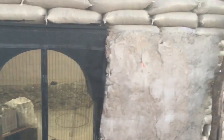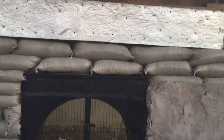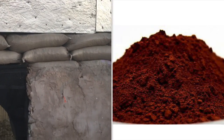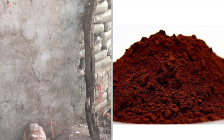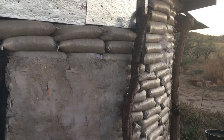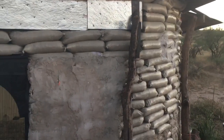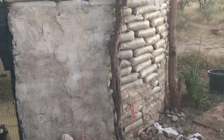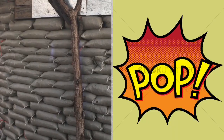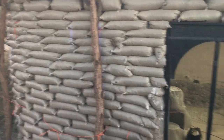We're gonna start doing the stucco on the outside here. We're actually using an iron oxide colorant so it's gonna have this reddish color — it'll look really cool and we don't have to paint it. I'm gonna be putting a spar urethane on these branches to make them pop with a nice shine. It'll have UV protection — probably have to coat them once a year — but they'll turn out really nice. I've done it before on other projects so it's gonna look awesome.